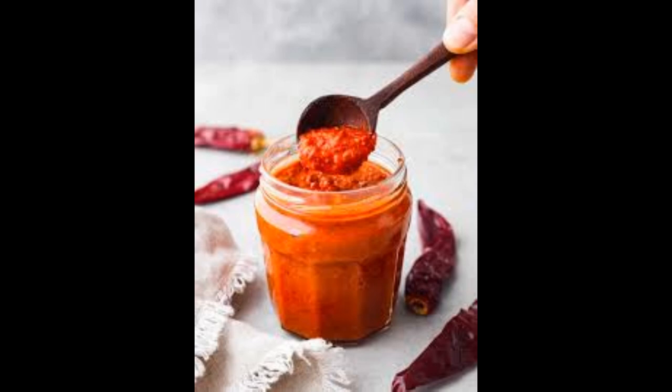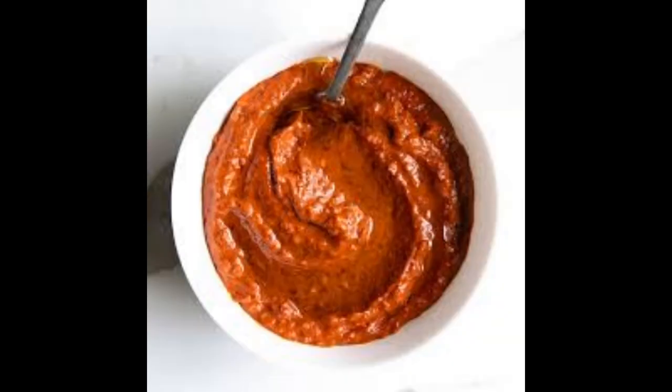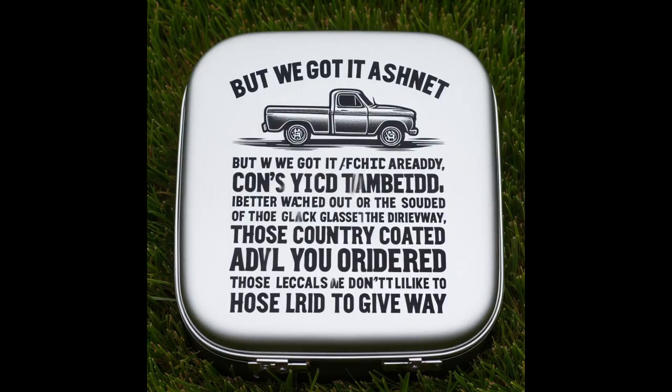3. Zinc: Cu²⁺ + Zn → Cu + Zn²⁺. Faster reaction rate than nickel or lead. Widely available and relatively inexpensive. Zinc sulfate byproduct has agricultural applications. 4. Aluminum: 3Cu²⁺ + 2Al → 3Cu + 2Al³⁺. Very rapid reaction rate. Highly exothermic reaction. Produces aluminum hydroxide precipitate in basic conditions. Comparison summary: reaction speed, Al, Zn, Pb, Ni; precipitate purity, Ni, Zn, Pb, Al; cost effectiveness, Zn, Al, Ni, Pb; environmental concern, Pb, Ni, Zn, Al.